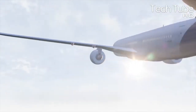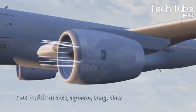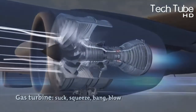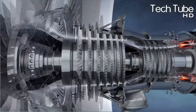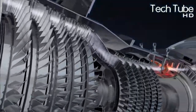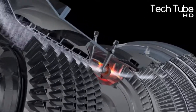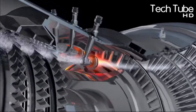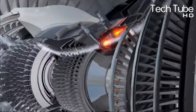You may have wondered how the airplane's engine works in the air. For the case of a gas turbine of planes, the air is taken in by the frontal giant fan. Most of the air is directed around the engine with intensity, while the remaining air enters the engine and is compressed by the compressor containing a number of blades. As the pressure rises at every stage, the air is compressed and the combustion chamber integrates the fuel and ignition.